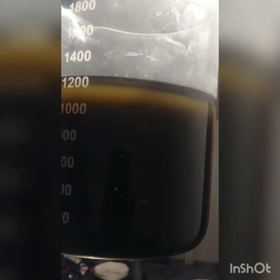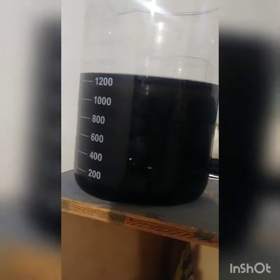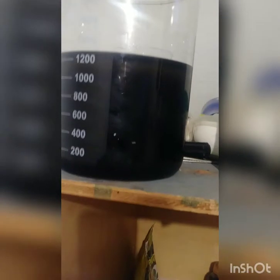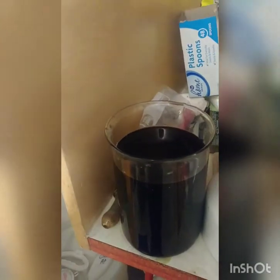What I do is let the acid settle for a few days. You can already see the line on top — that's the gold settling down. Being patient is key. Once it settles for about three days, I can pour off the sulfuric acid. There might be a tiny bit of gold in there, but you decant as carefully as you can before you start pulling gold into it.